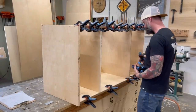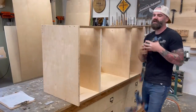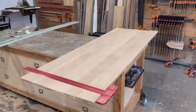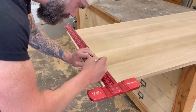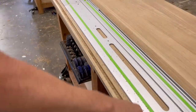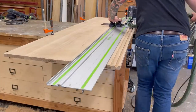After that glue was dry, I removed all the bandy clamps. After doing the facing on my top and bottom pieces, I added some facing to my middle dividers. While I waited for that to dry, it was time to start adding some detail to our oak slab. I got one of these quarter-inch shank cove bits from Bits and Bits, and I'm going to use it to add some fluting to the front of this panel. I marked out across the entire thing exactly where I wanted my coves to be carved, then I got out my Festool track with the matching router that hooks into the track, chucked up that cove bit, and started coving.